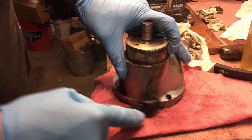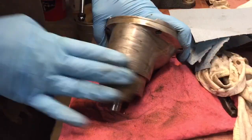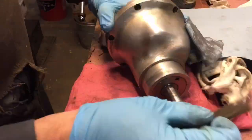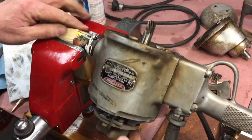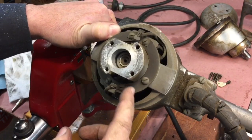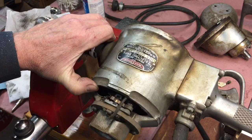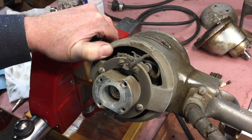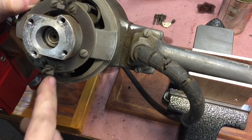To clean off the tar and oil on here, I'm going to take some acetone and a genuine brass brush, followed by some fine Scotch-Brite with WD-40 to get all the residual goo off. A jig like this is really handy — you can spin it around and see what you have to deal with. Looking inside I can see the commutator looks in very good shape, no grooves, perfect color. The brushes still have a lot of life in them. The cord obviously needs to be replaced.